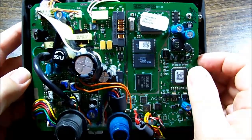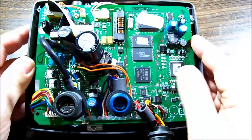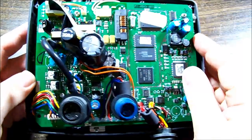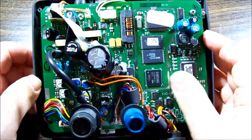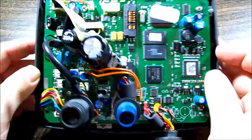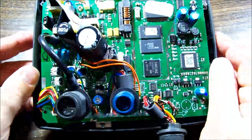Alright, I'm going to start with the power button, just make sure it's nothing simple, make sure that it's got an expected voltage on there. It'll probably pull it to ground to tell the processor to turn on, or some power circuitry to start up as well.